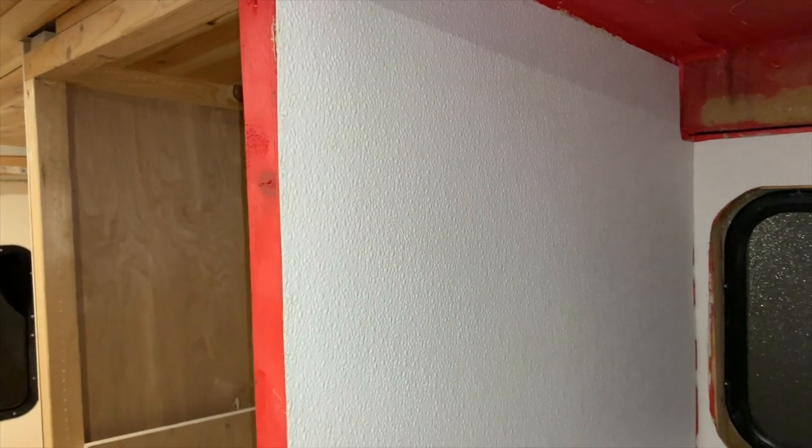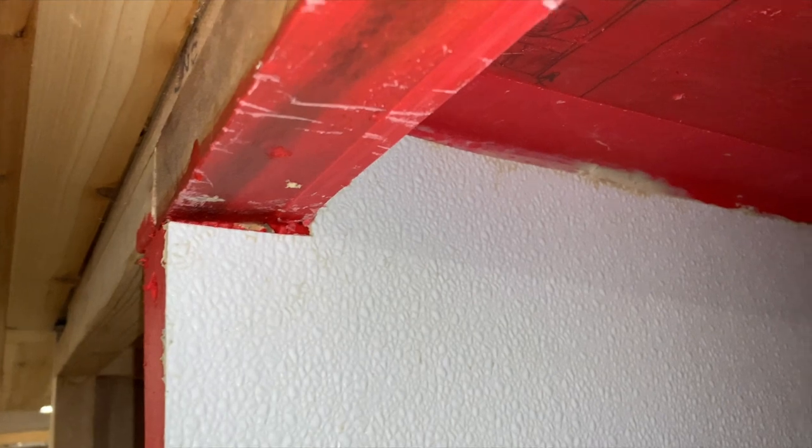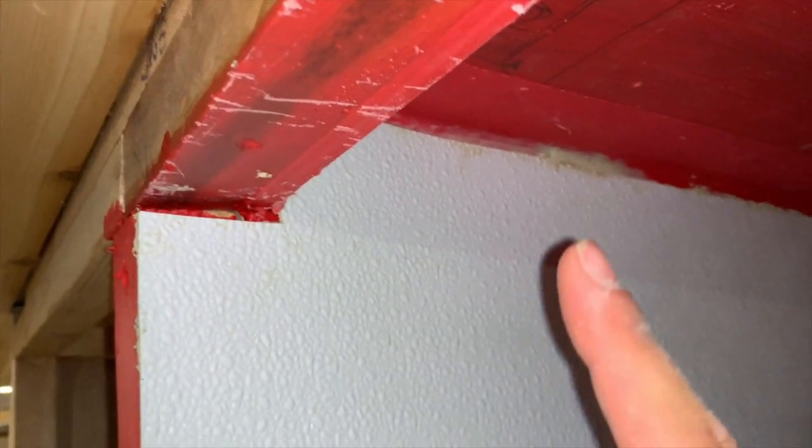FRP in terms of what it does is great, but getting it on is a pain in the butt. It kind of got everywhere and it's probably not as noticeable as I'm making it out to be, but you can see it all up there. I was scrubbing with a sponge, a toothbrush, just whatever I could and it wasn't coming off — it was drying really fast within minutes. It even got on the tub bottom and once it starts drying it's like cement. You can't get it off, so I'm a little frustrated because these are expensive.